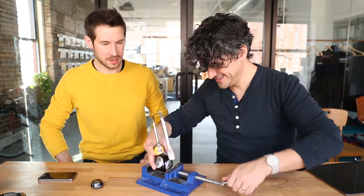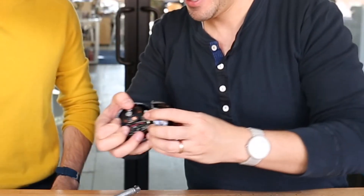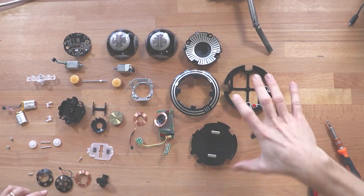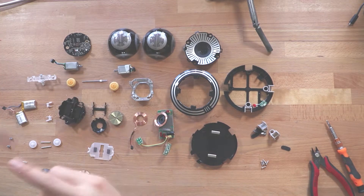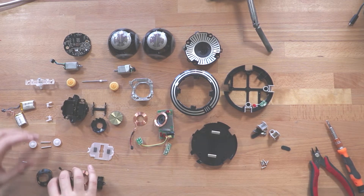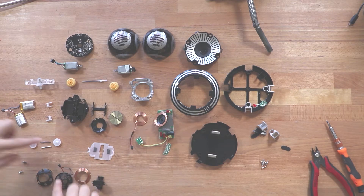What do you think he's thinking right now? He's a little bit worried. That is so neat — look at that. We tore this apart. We've got the pieces from the Sphero ball and its charging base. So you've got the ball, which we split in half. The ball meets the rollers; the rollers rub up on the inside of the ball and are connected to motors. The motors can drive together forward, together backward, or in opposite directions. By doing that tank-tread thing, the ball will pivot, roll forward, or roll backward. All of that sits inside a chassis which has the batteries and the induction coils connected to it. Then this PCB plugs down on that and makes connections with all of these little plugs.